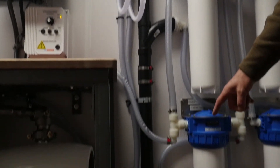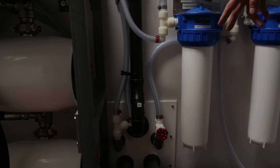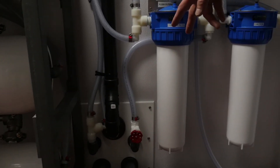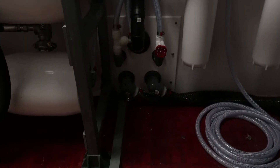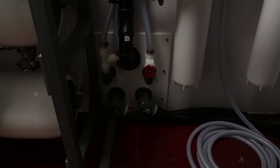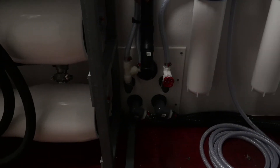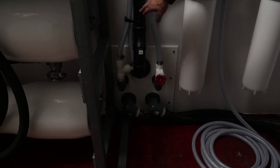These are the inlet and outlet ports for all the water coming in and out. The water coming in are the two flex hoses on the bottom — this is actually chlorinated water coming back from the pressurized storage system on site. These two hoses over here are the product water going out, and the black one is the drain.